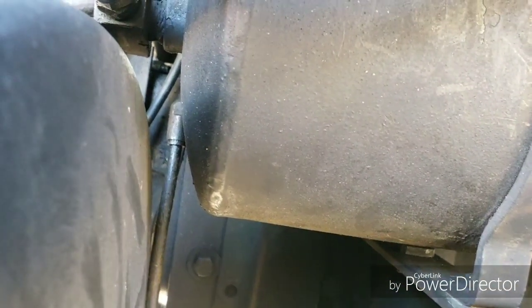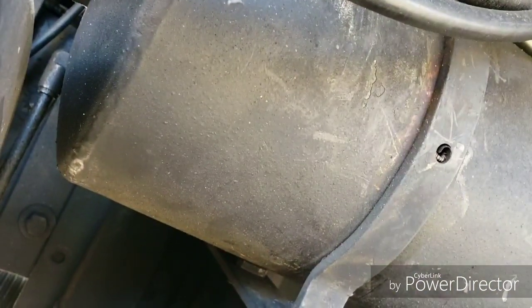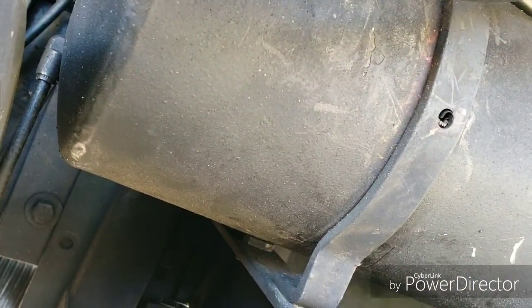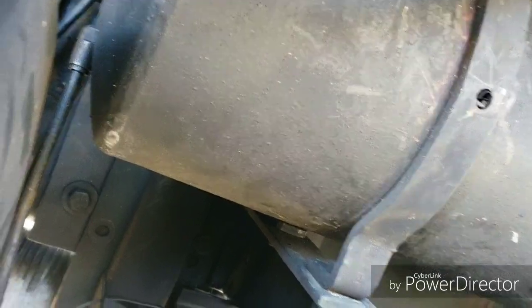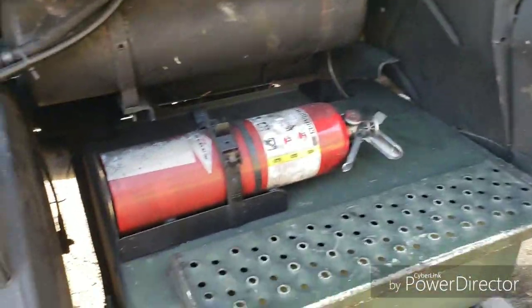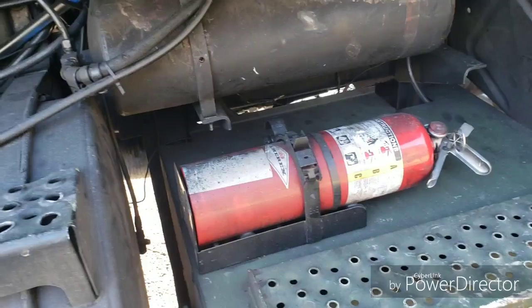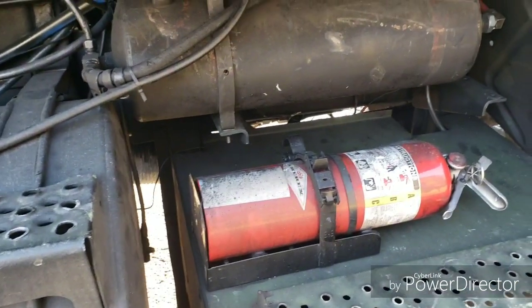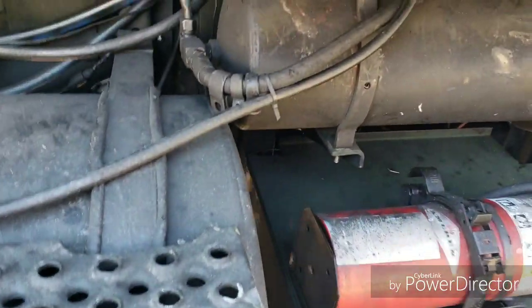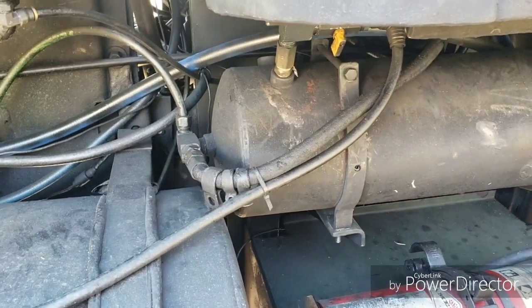You can pull off the lines and find out which ones are leaking down the quickest. I've got a slow leak on the windshield washer switch, and that's causing most of my remaining problem. But it's not as bad as before — earlier it was just pouring out air, dropping five pounds a minute. So that's it.